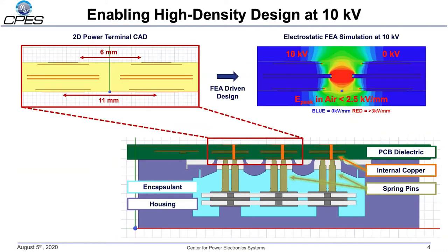However, with this drastic reduction in terminal-to-terminal spacing comes increased electric field strength around the terminals, which must be carefully managed to allow for breakdown-free and partial discharge-free operation of the module. Shown in the top left is a 2D CAD model of the field grading geometry inside the PCB integrated bus bar. This geometry is carefully designed using an FEA driven numerical optimization technique to ensure the electric field in these regions is kept at a manageable level.